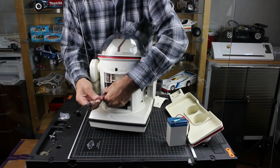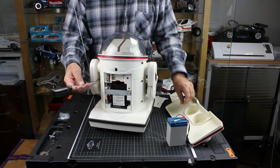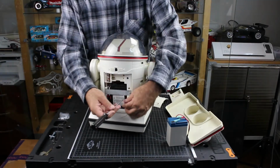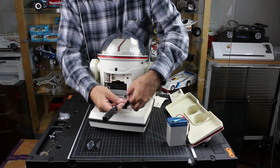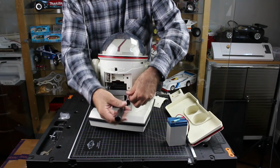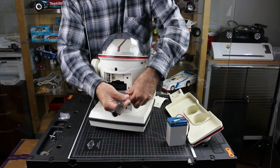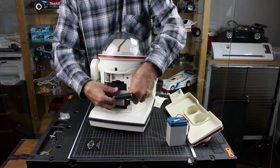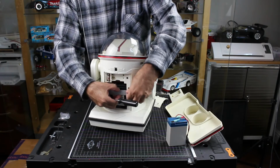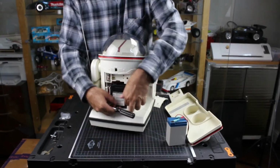These are lead acid batteries, kind of like your old car batteries. Once they sit around forever, that's it. They're dead, and it's hard to revive them. I mean, you can by opening them up and putting in distilled water and giving them some electrical treatment, but it's just not worth it. You can buy a new battery for a lot less than the trouble you'd have to go through.